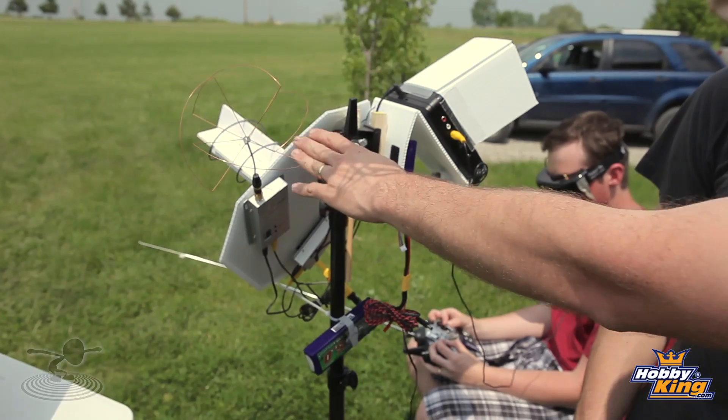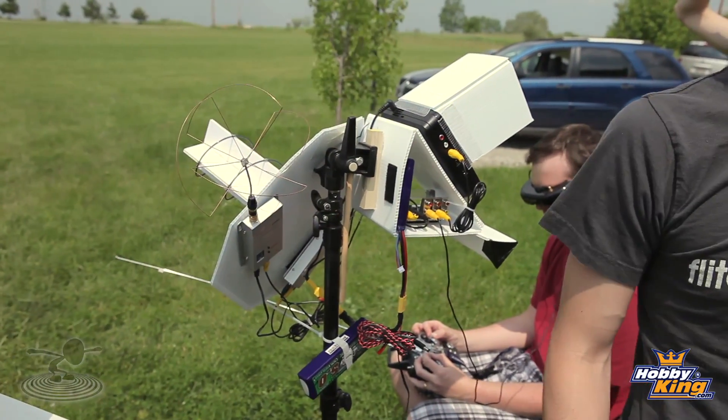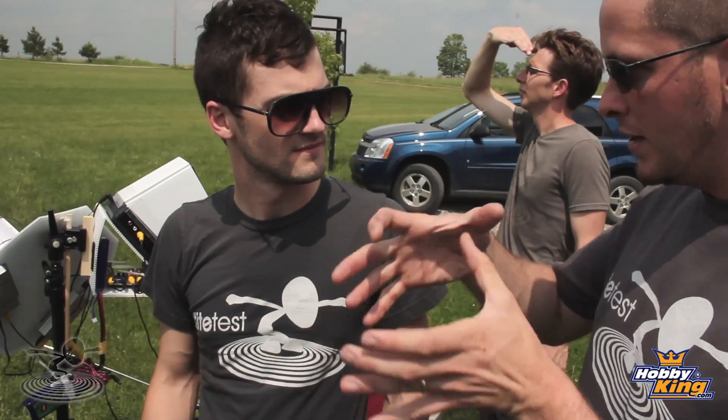The Eagle Tree does a whole bunch of great stuff. Along with that signal, it can also be used for an antenna tracker. We have diversity here which is really great, but this long-range directional antenna can have an antenna tracker that will actually keep it pointed right at the airplane in real time. So that's a really nice feature if you want to fly far away — in any direction around you — using a long-range antenna.